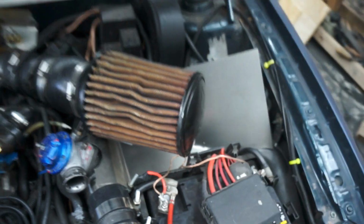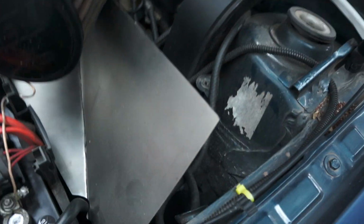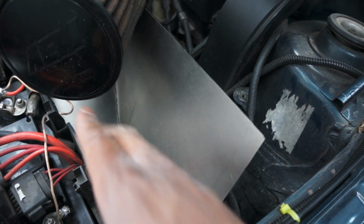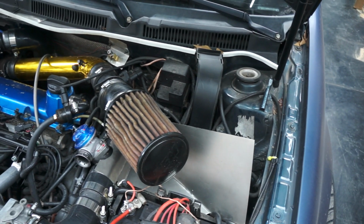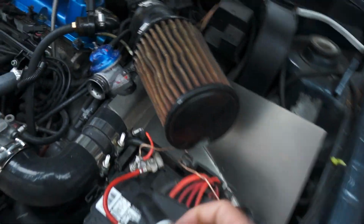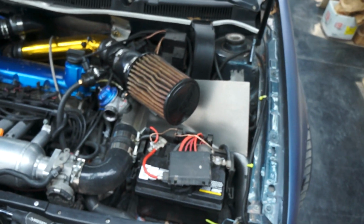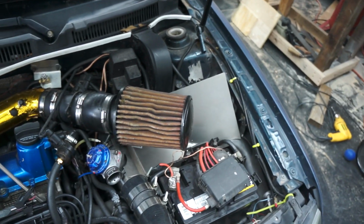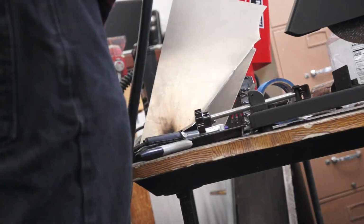And then, like I said, I just have to bend this piece back and get it flat with this bottom tray piece, just so we can start welding up the walls for the edges there. So I think those are going to be the next steps. I'm going to go ahead with this Sharpie and kind of mark where this is sitting right now, just so I can go ahead and tack it on, and everything can be ready to go and ready to start welding.